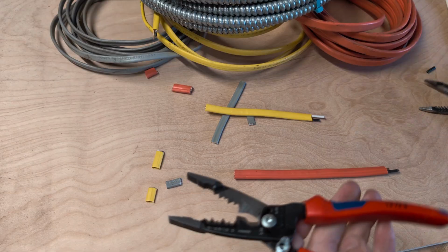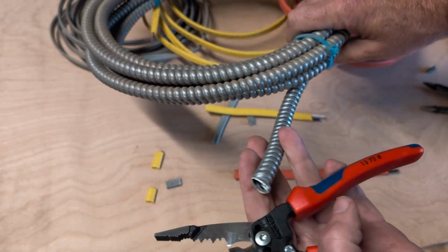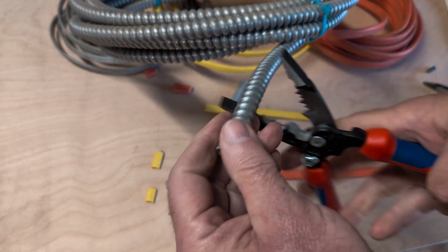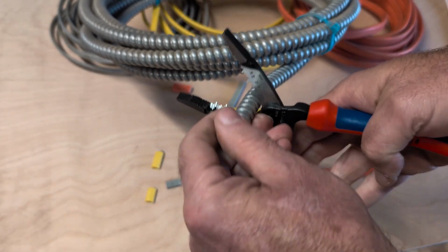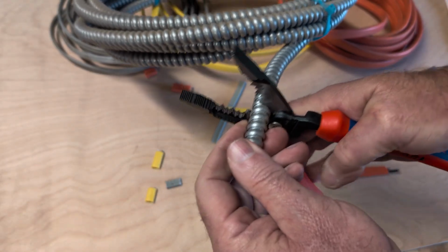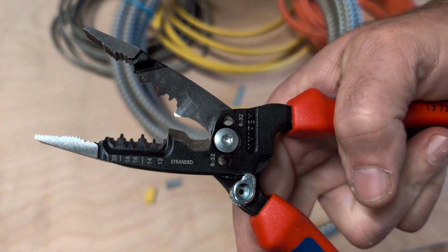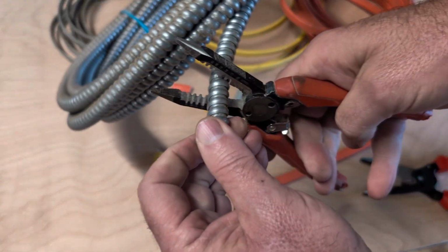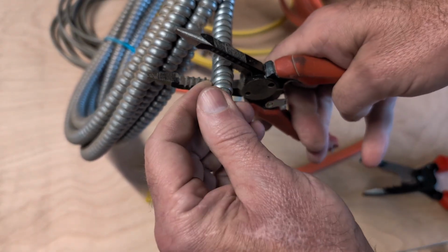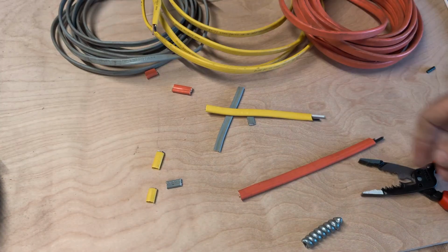And what's that good for? Here's one of the things I saw. Now this doesn't have the wire since I stripped it out for some reason. I can't remember why, but you want to cut some EMT in there like that. Opens it up. Gets it in there. It's a little wider on your fingers. Maybe you get down in the hole there. Cuts. And there you go. Snips right through it. Look at that. Just little scratch marks on the jaws. You try that with your Milwaukee, you can't even get them down into the cutting section, into your shear area. So yeah, cuts through that, no problem.